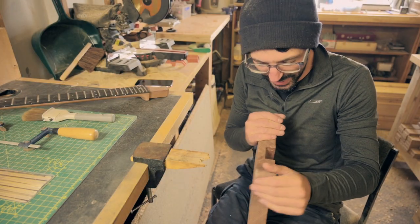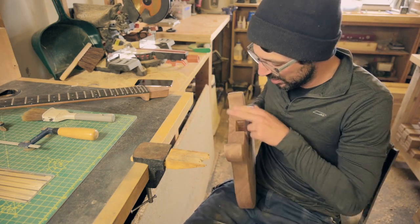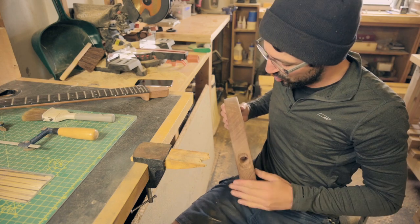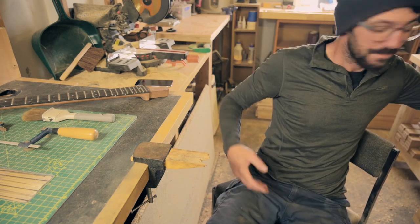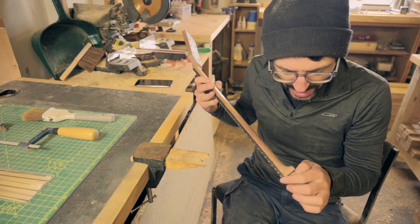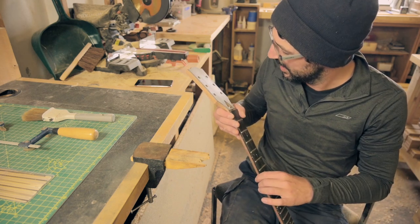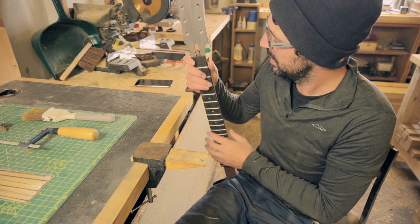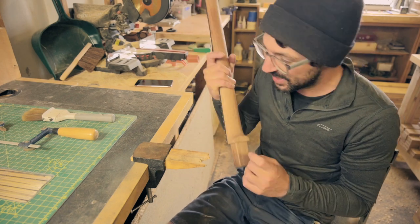I've procrastinated away the best part of 4 hours yesterday sanding the body. Well, it's currently about 400 grit really on the end grain. I still have some scratches to remove, but generally it's feeling very, very nice. So that's sorted. I've also done the same thing to the neck. So yeah, it's about 400-ish. Really not any scratches left to remove on the neck. Just a little bit of work required on the front of the headstock for this thing that I keep putting off. So I've done pretty much the final fitting as well of the neck tenon, so that's all really good.